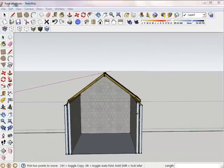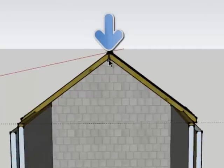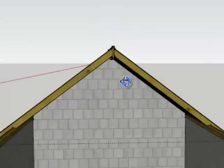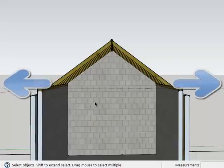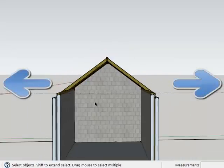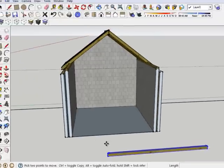This building is quite a bit larger — it's more than three metres across — and if we were to put any significant loads on top of the roof at the ridge, we're going to end up with much more of a bigger load at the sides trying to push this roof apart. So what we would do with a roof like this is tie the two sides together with another piece of timber.